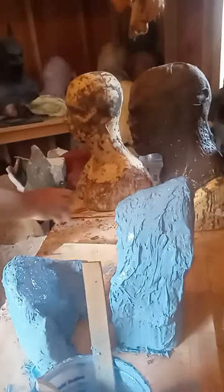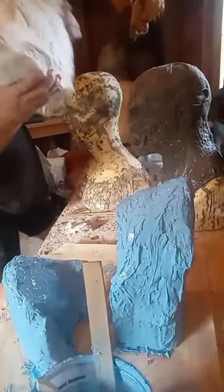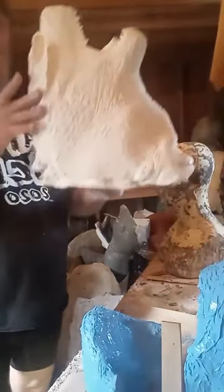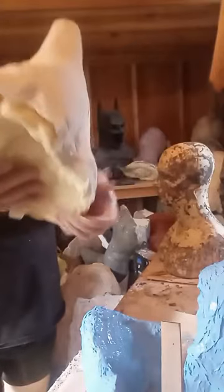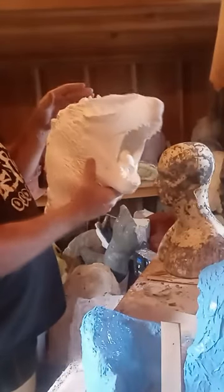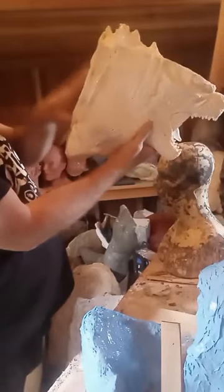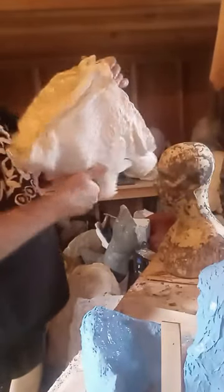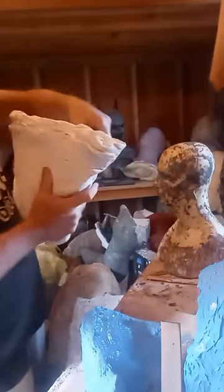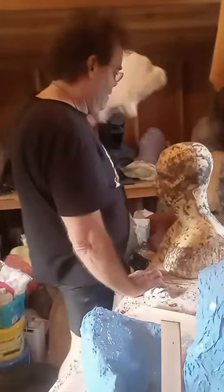I'll give you an example. I've got one right here. This is an outer shell of resin on a Godzilla. Outer shell of resin, inner shell of foam. Now this is a master copy, so if anything happened in the mold and it broke, I'd have a separate thing to mold off of. It's going to be hollow like this on the top and the bottom, and then it's going to be filled with foam. And then the back part will have a little board inserted in the foam so it can be hung up. It's going to be done in two pieces, with a hollow backing on it.